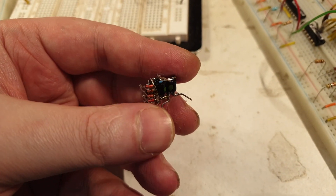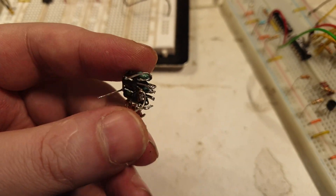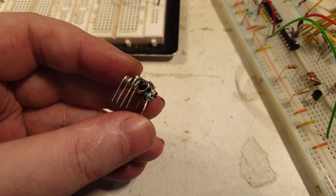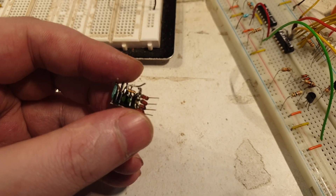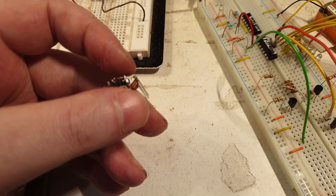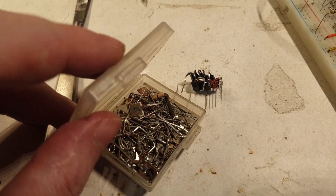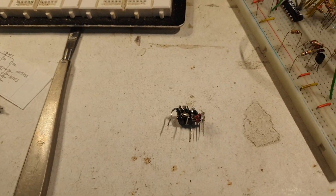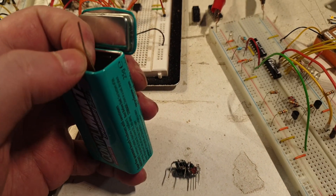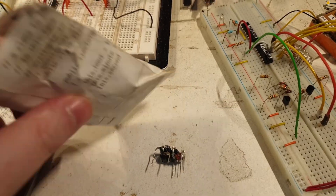Those are the two transistors and I deliberately left some bent wires in various places, because the plastic I pour into it will go through all these orifices — hopefully filling every crevice and making it extremely solid. Right now it's very bendable and fragile. I bent up the pins of the diodes and soldered them. I also have a ton of pins that I cut — solderable wires — and thicker copper wire from old component pins.